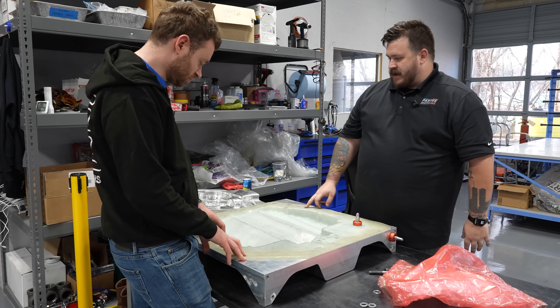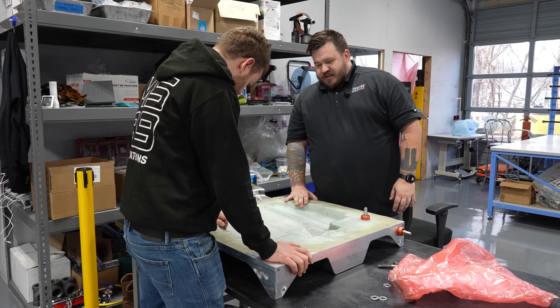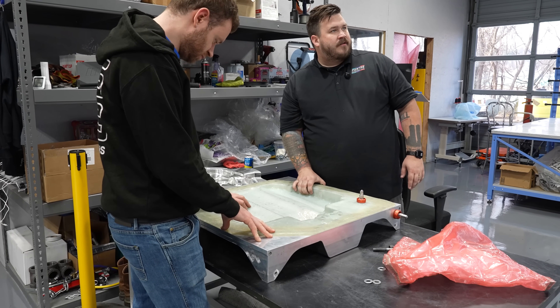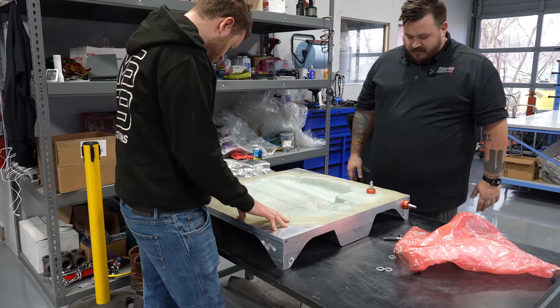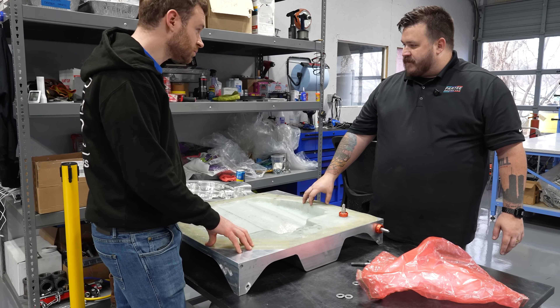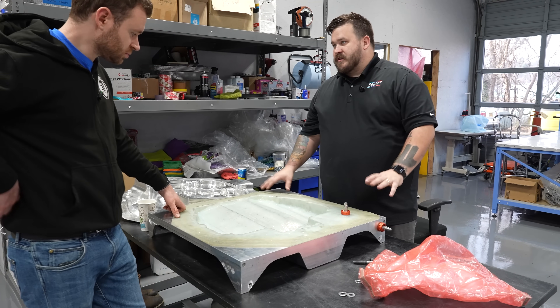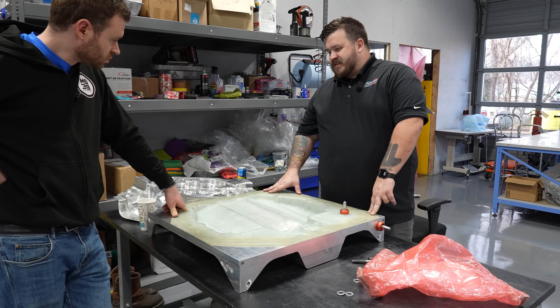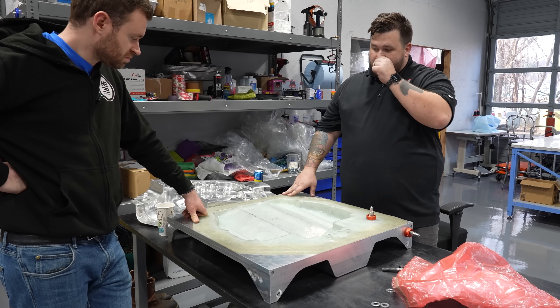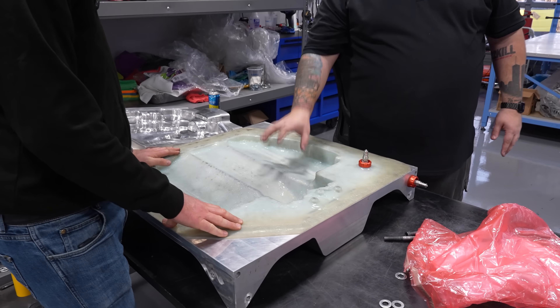Typically, to vacuum bag with traditional film would take about an hour and a half or longer — you have to be very meticulous. With the silicone bag, you just put it in place, connect your vacuum to here, and this groove becomes the seal — the wedge presses the silicone down into it, creating a vacuum seal. Connect another vacuum port here, and in about five minutes you're done. This is infinitely reusable, so it's less waste. This one has done about 20 to 30 parts already and is still in perfect shape — good for probably 50 more. This is going to be our approach on all future parts where it's applicable.